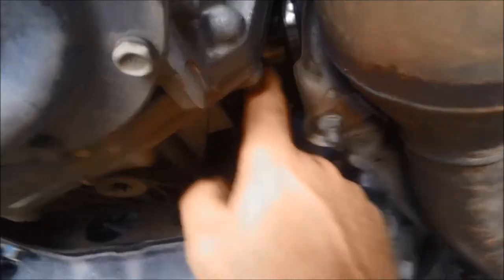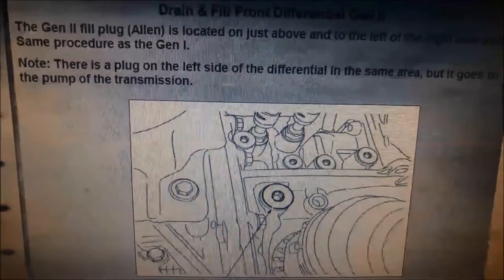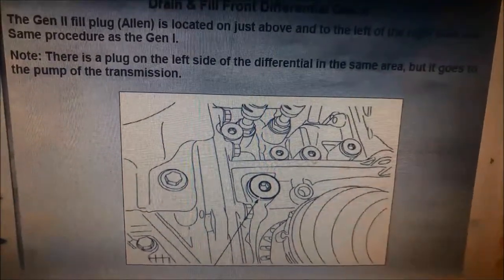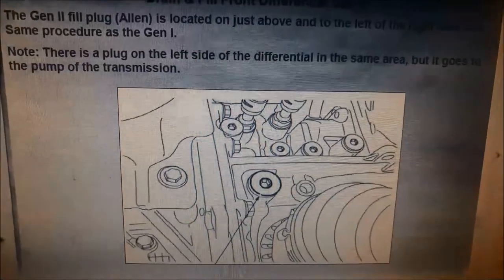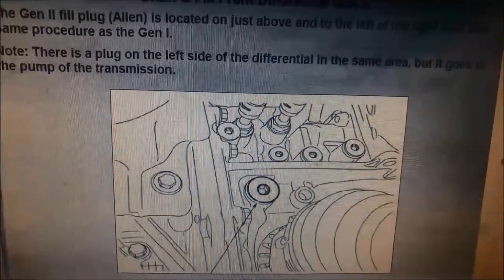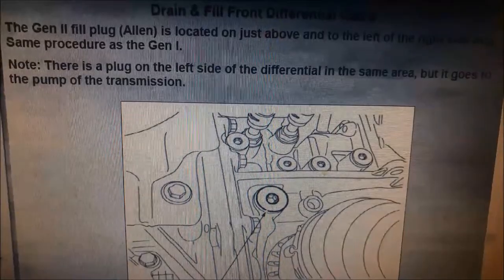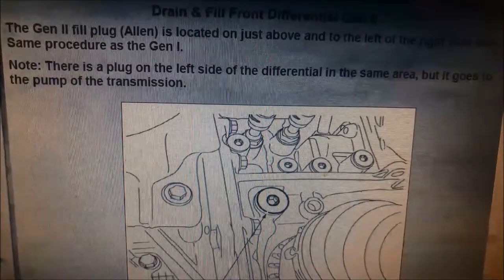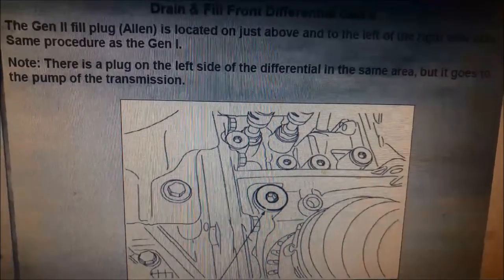You've just got to be aware that the oil isn't common to the transmission and the front diff — good idea to check it while you're doing the service. To fill the front diff there's a plug — it's a little bit hard to see — just above the right hand side CV joint. You'll see there's a little allen key plug there. Now make sure you don't mix up the plug. On the Gen 2 TR580 you'll find there's a plug above the left hand side axle, but that one actually goes to the transmission pump. So make sure you don't mix that up or you'll be in strife — you'll think you've topped up the front diff but you've actually pumped gear oil into the transmission. Your transmission will be over full and your front diff will be low on oil or no oil.